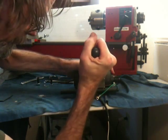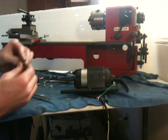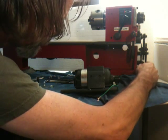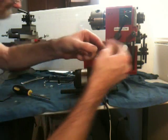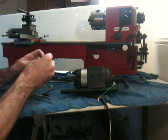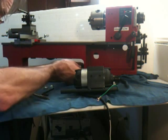There we go. Next we take one of these 10-millimeter dog point screws and go ahead and spin that in. That was the big hole where I thought the change gear pivot was supposed to go. Let's run that out so I can see the end of the dog point set screw. Let's get this other one started.